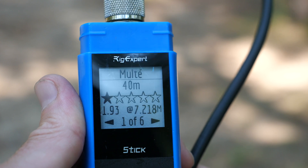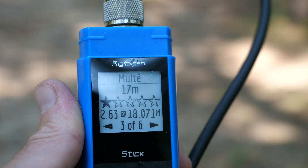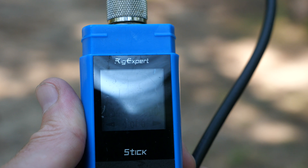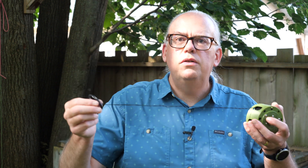The next morning, as I continued my test, the bands did improve and I was able to get another 50 digital contacts in my log — split between 40 and 20 meters FT8 during about a two-hour on-air session. Out of the box, the SWR of this unit was a little higher than what I was expecting, especially on the 40-meter band. That can mostly be accounted for by location and deployment, and I would try this in a couple of different spots before making any final judgment or changes to the antenna. On 40 meters the antenna was about 1.8-to-1 in the phone portion of the band and about 1.4-to-1 at the bottom of the band. You do get a short amount of extra wire at the end so you can make fine-tune adjustments to find the sweet spot for your particular style of operation.